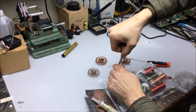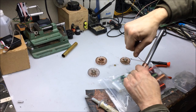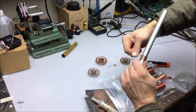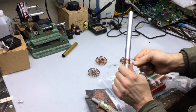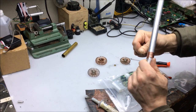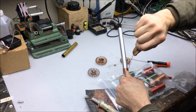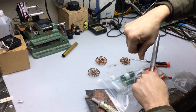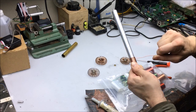The smallest I've tested on there is right around 8.2 megahertz, and it's a real tiny little bugger. The smallest one that I managed to build rang at about 3.5 megahertz — that tiny E-Hooka one. It's kind of funny that the handheld magnifying transmitter happens to have such a high frequency — it rings in right around 5.9 to 6.1 megahertz. Wow, that is pretty quick for something that size.